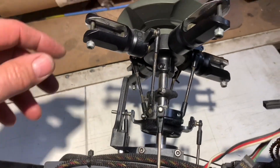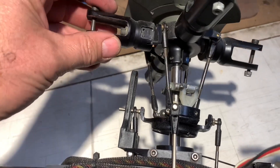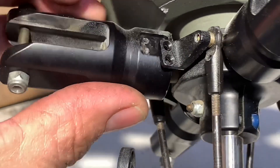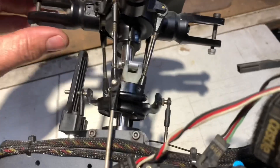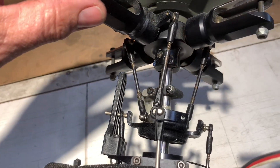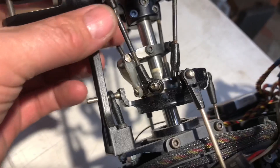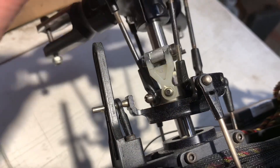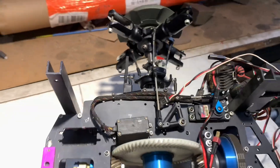Looking at the rotor head — there was one where the bolts got stripped out on this little piece right there. The screw heads popped off; one popped completely out, so I'm sure I'm going to have to rethread that. But for the most part it looks straight. I don't think it had power on it when it hit — I think I got it off before it actually hit. You can see the forces on this little piece of plastic, but everything's running smooth and clean.